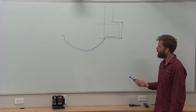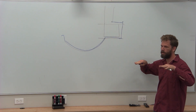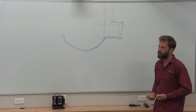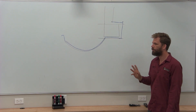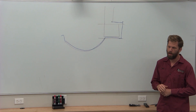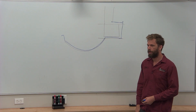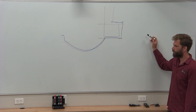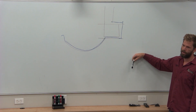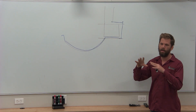A double trap prevents drainage because it traps an air pocket in the high section. Anytime there's a high section where water can spill down and fill two different sides, we have a trap with an air pocket in the middle, and the water will come and push that air pocket but actually not push it through. If it's subtle enough, you can sometimes get a bubble — you'll hear a little bit of bubbling, it'll work its way through, and then eventually get stuck. A sign from outside would be intermittent dripping — the drain could flow really great for 10 seconds, then stop for 10 seconds, flow and stop, on-off on-off, bubbling through that middle section trying to work through that bubble.